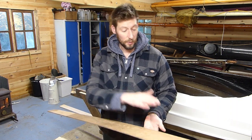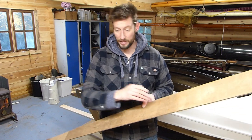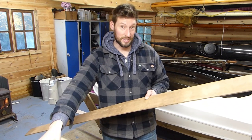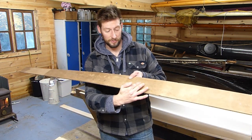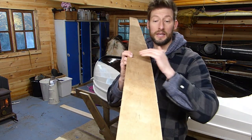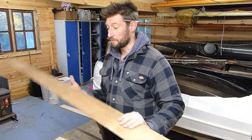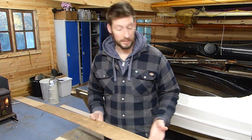The way I'm going to do that is I'm going to simply lay it down, orientate it by eye, find the widest part, and then use my sliding rule again, just to match the outside edge of this to the center line of the stock. Mark the centre line that's on the stock back onto the template, create that line, and then cut off the flush. These little dotted markers you're seeing here indicate the centre line of the template. I'll line them up, cut them out flat, plane them smooth, and then I can put that against the centre line of any bit of my flat stock, and that should give me the template of the paddle, or one half of the paddle.